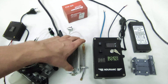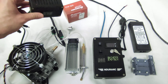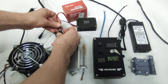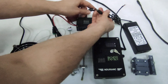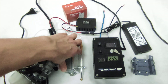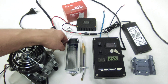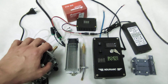But when it's around 20 Celsius or even colder, you'll probably need this box — this is our DCDC system for TEC cooling controller. You connect it to the TEC cooling with power from the ACDC supply. It actually reduces the power going to the TEC cooling. You'll see some numbers, maybe 8 or 9, meaning that out of 12 volts, you only give 8 or 9 volts to your TEC cooling.